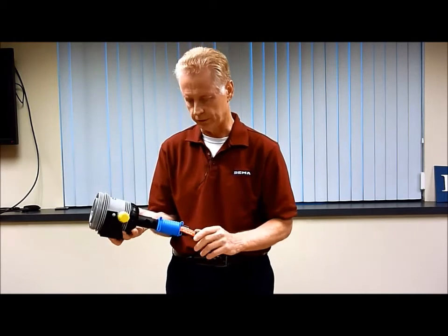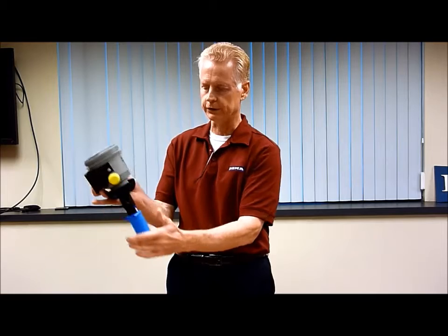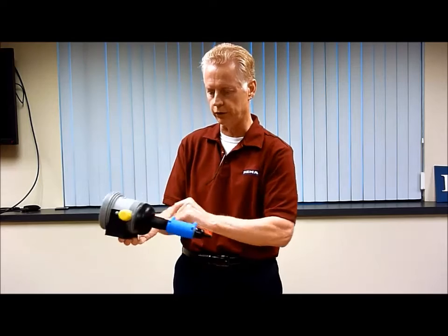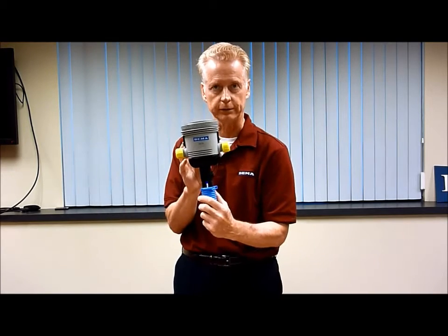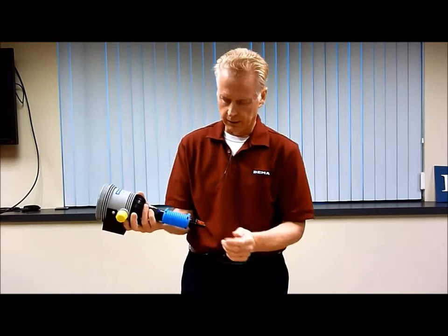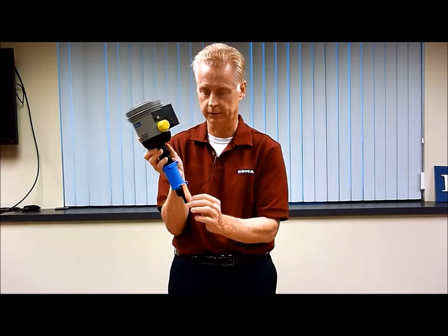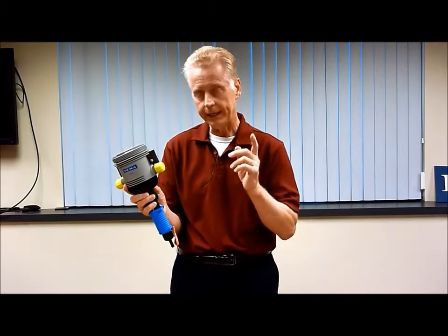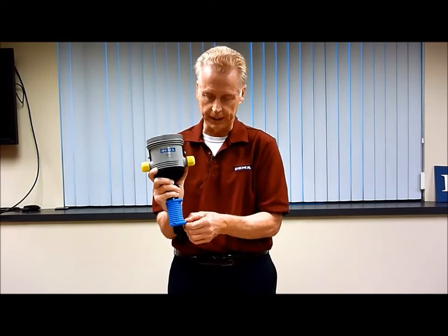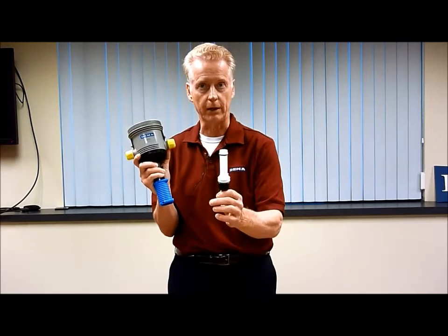You can flip it if you want to — by undoing this nut, lowering the part below the support sleeve, and then tightening it back up again. Now you see ratio on the front instead of percent. This U-clip right here has a red tag on it that says 'do not remove — for maintenance only.' That is there because if you remove it while the system is pressurized, this is going to come out and your feet are going to get wet.